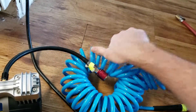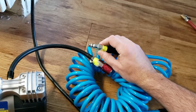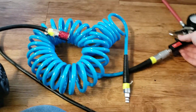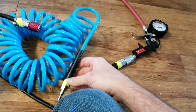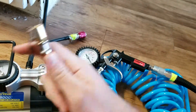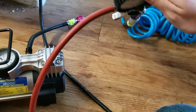These hoses usually come with quarter-inch NPT male threads, and you can get more adapters. What I've done is put a male adapter and a female adapter on this air hose, so I get another 25 feet, with a little tape on there to keep them airtight. That connects to this chuck, which gives me a reading up to 100 PSI of whatever I have connected, so if I connect this onto a tire valve stem, I'll get a pressure reading off of here.